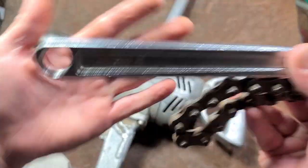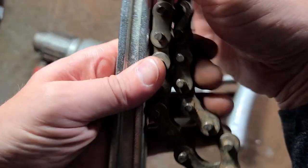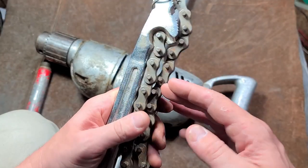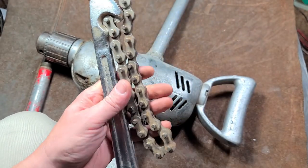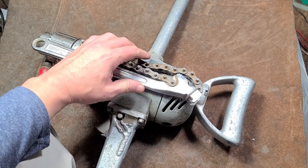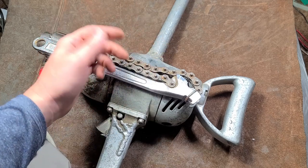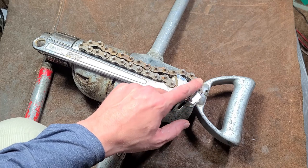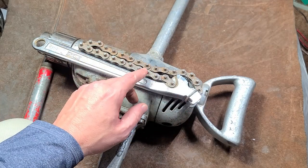That's my review of this Empire chain pipe wrench. I don't think this is made in the United States, even this older one. One warning: no hammering, no extensions, because you'll easily shear the pin right here and the chain will pop off. Not my favorite chain wrench. I'll keep it in my collection unlike the last one which I got rid of, but generally speaking find a different design that does not have this dual-mode jaw — find one that has a nice curve and is single direction. You'll have a lot better luck with those chain wrenches.